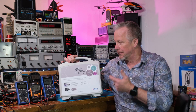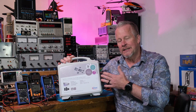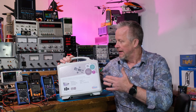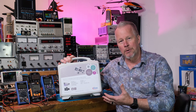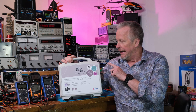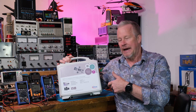I've had this for a while. I started working on these kind of converters a couple years ago, did some videos, and then it's kind of gone quiet on this front. But I'm going to bring it back up because for our audio amplifiers and other types of loads we're going to want this LLC converter. This is a 600 watt LLC sent by Infineon — they send these to power engineers like myself to evaluate. I did a GaN converter about a year and a half ago with an LLC; this one is with MOSFETs.